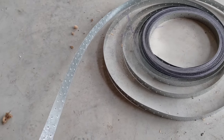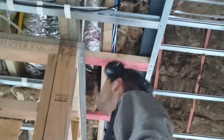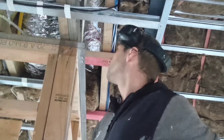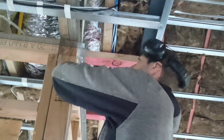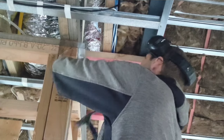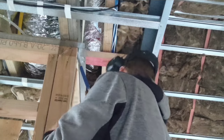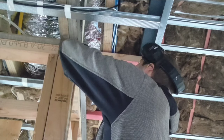I'm going to use some of this roof plane brace. It's basically the same as the straps we'd use — it's just a big roll. So what we want is the strap that holds this down to come down onto the stud, which is then fixed down to the ground. I might get away with not moving this — we'll see how it goes. Now this perimeter channel is nailed on. I don't want to completely take it off, but I just want to make sure I've got enough gap to get that strap through. That should do it.